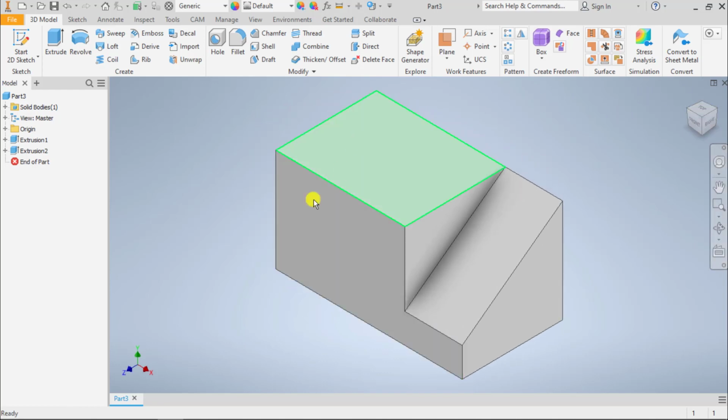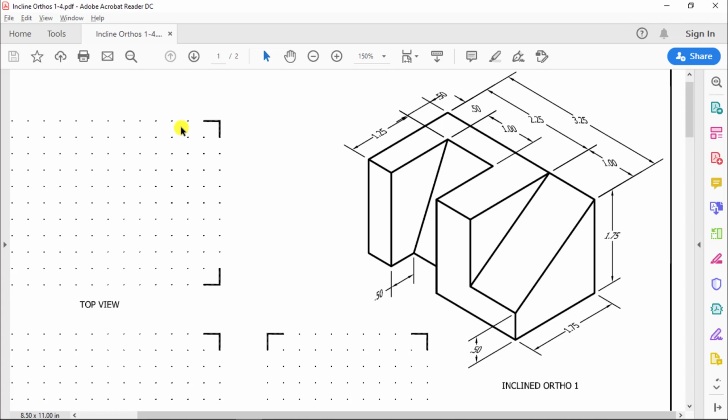All I have to do is cut this other chunk out here. So if we pop back, let's look at what we know about the profile of this cut. It's kind of a trapezoid. This is 0.5, and then it comes up on some angle that we don't know or don't care about. And the reason why is we were going to use descriptive geometry, and descriptive geometry tells me that if this line starts at the bottom 0.5 in, goes to the top 0.5 in, that's all I need to draw that line. So the bigger question I have is, where do I sketch this shape right here?